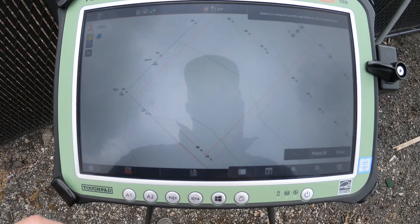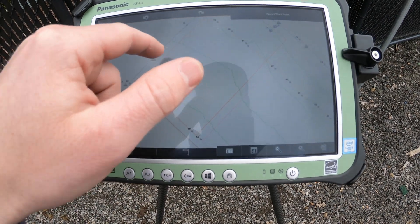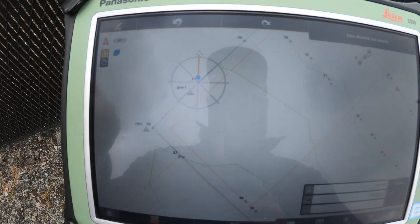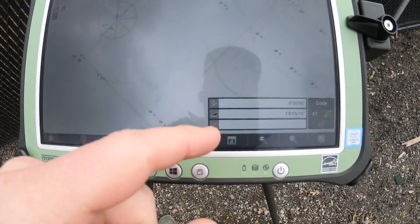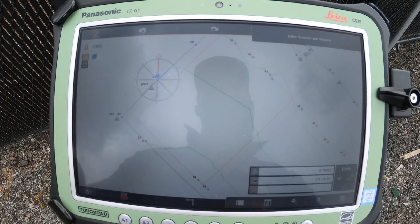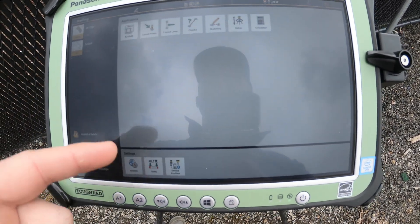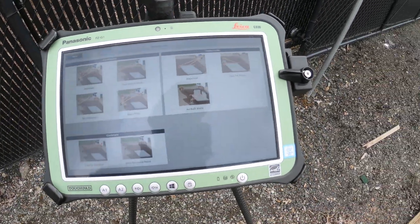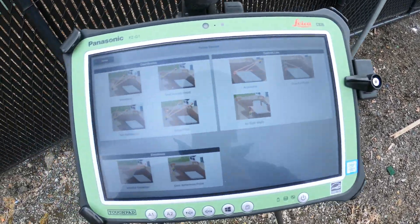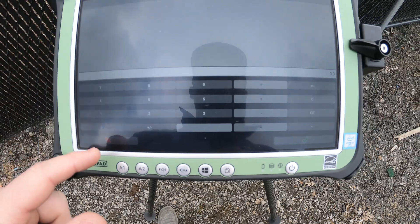Back home, then we can do sketching, which is where you click a point and get a little pinwheel. You can actually sketch in points from a different angle to a different distance. Through the software you can add points and lines and do offsets. Then setup is just to set up the total station on site, and you also have a calculator if you need it.